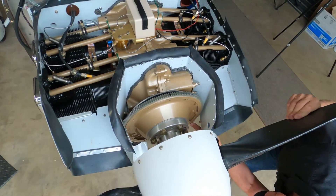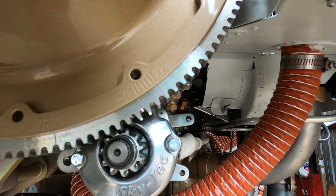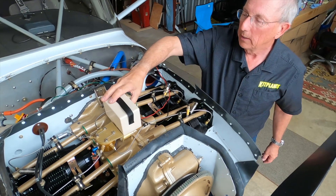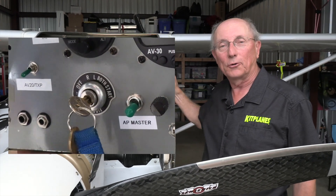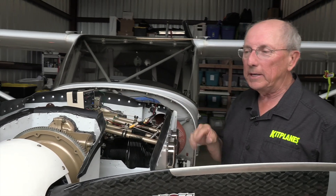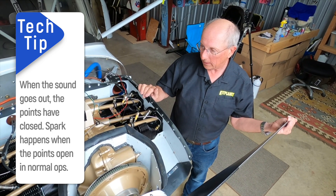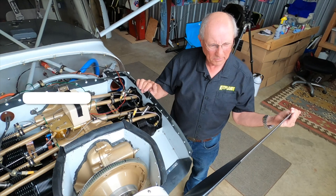What we really want to time the mag to on this engine is 20 degrees before top dead center, so we come back to the 20-degree mark. We want to go a little past it and then come up on it so we're always moving forward — that takes out the gear lash. Now I've got that lined up at 20 degrees before top dead center. I'm going to turn on the buzz box and you'll hear it doing a little screaming at us. If you turn on your buzz box and get no noise and no lights, that probably means you need to turn the ignition switch to both — and that's safe to do now that we've disconnected all the spark plug wires. It's screaming at us because we're right on time. I'll move the prop just a little bit and the lights and sound go out. Coming back up on that spot — there's the left mag, there's the right mag, and I barely moved it. Much less than a degree.